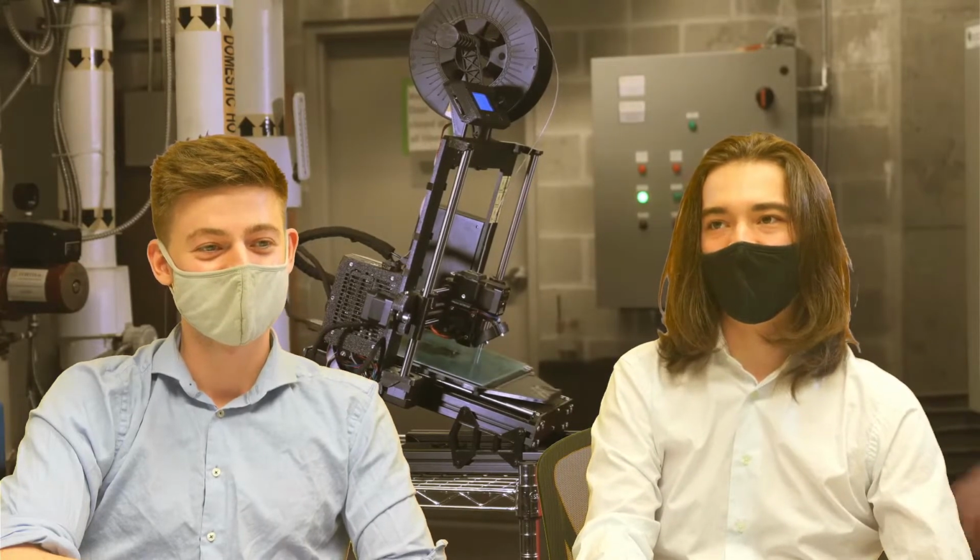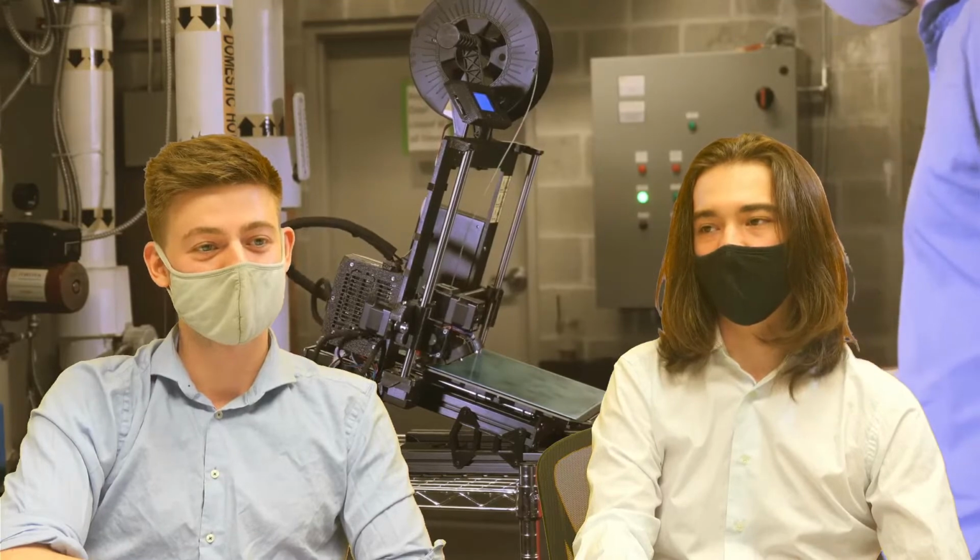You'll start to encounter really weird things that you never would have expected, whether it comes to slicing, or thinking about slicing over long production runs or things with your printer. One interesting thing we discovered when we started running our print farm was that plastic filament can literally slice through brass extruder handles. If you print miles and miles, or kilometers and kilometers, of plastic, it'll eventually wear a groove into your extruder to the point where the teeth are just smooth and they don't grip the filament anymore.